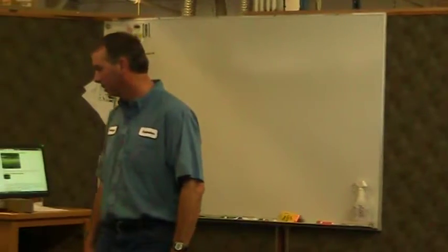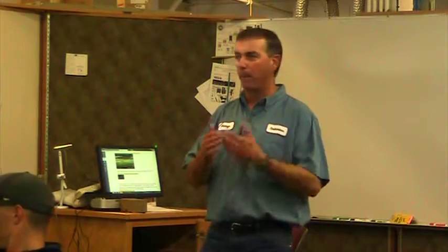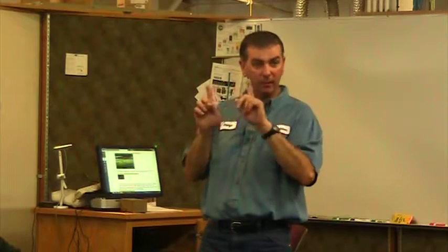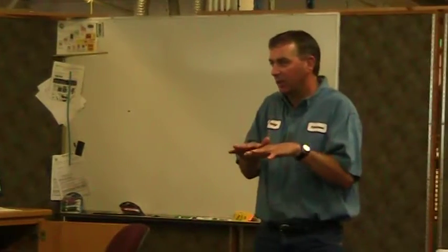Should you cut any grass? You would think no, because I already cut it at 90. I shouldn't come back and cut it again and get any grass. But when they came back with a rider, they would get baskets full of grass again. Partly because you don't get all the grass, partly because maybe with different brushes we stand it up better, and we're going to cut the stragglers that we missed. And partly because a riding greens mower is heavier and it actually cuts just a hair lower. So it was a combination of different things.